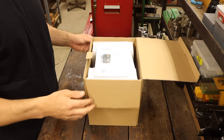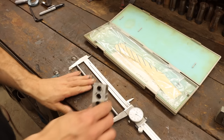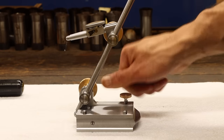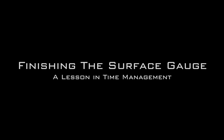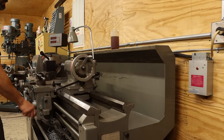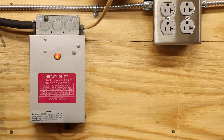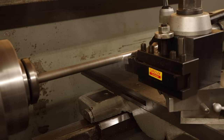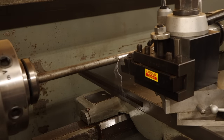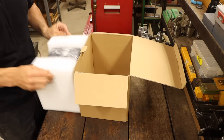There's just one little thing I need to address before I can get started. The static phase converter I'm using to create three-phase electricity for my lathe simply isn't doing what I need it to. Turns out this type of phase converter only creates three phases for a couple of seconds to get the motor running, then the machine lugs along on one phase and is only getting about half the power. That means under normal operation, I'm constantly tripping the motor protector and then waiting around for it to reset, which really doesn't help with the whole time underestimation problem. To fix this, I need continuous three-phase electricity.